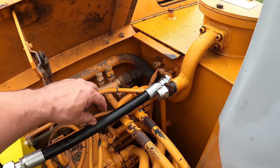So anyways, what I'm gonna do is take this off. This is just a cap on here. You can see it goes right into the tank. It's like a manifold that goes into there for things like what I'm doing, options. So I'm pretty sure this is number 8 BSPP, which there's a male on there, I'm pretty sure. Yep. See, it's an inverted flare. So that's just a cap.